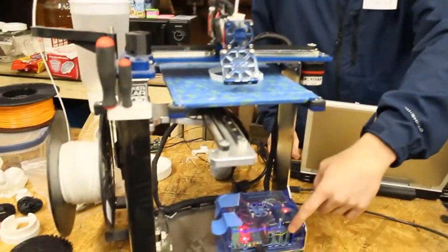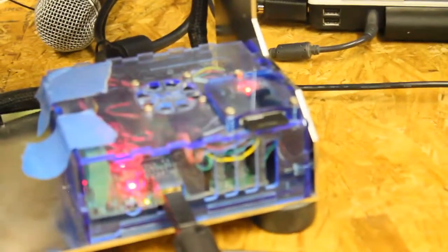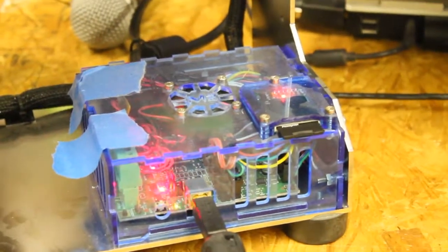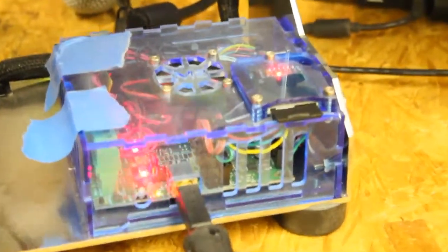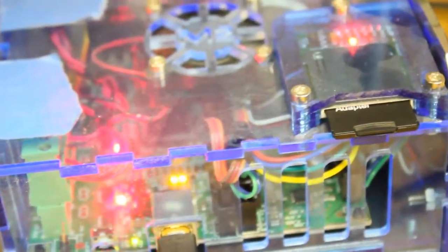What is the SD card setup you have here? They came with an SD card reader, so you can take your G-code files — your text files — put them on the SD card, then put them under the printer. From the software, if I choose SD, it says SD print and you can select a file that's on the SD card. Then once you've done that and it's all started and going, you can unplug the USB and leave it standalone from that point.